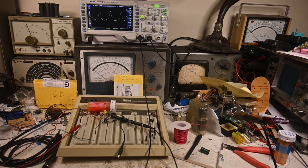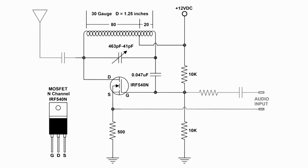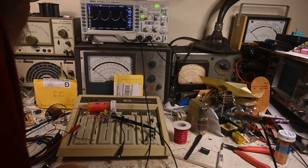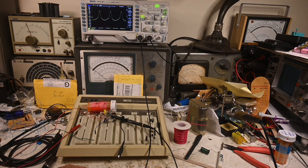I've been experimenting with different coils — got my glasses caught up in wire here. Alex wanted a higher frequency. This is the original coil in the AM transmitter, and here's the wiring diagram. We've got 20 turns on one side and 80 on the other, and the frequency reads 521 kHz, so it's at the bottom of the AM band.